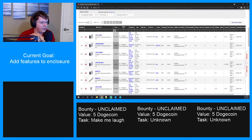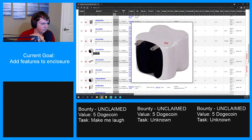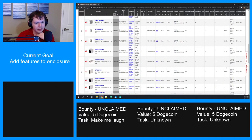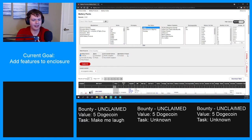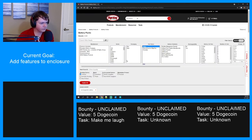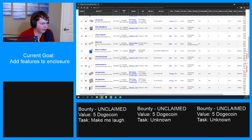Interesting. They're probably just taking batteries and putting them together is what they're doing. Yeah, I think that's all they're doing. But it does raise the voltage, which is nice. So that's an option. I guess I didn't think about that. We could just put some batteries in series and then we get our voltage required. Well, kind of. We're still going to need a regulator, I think. One that can push a lot of current, so...